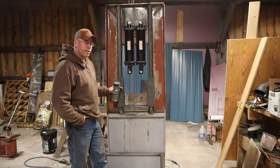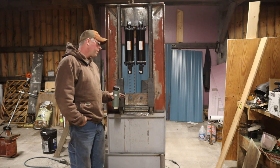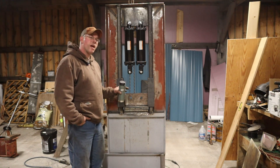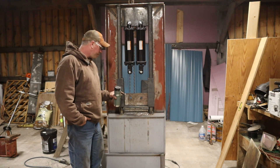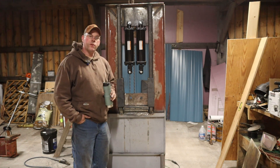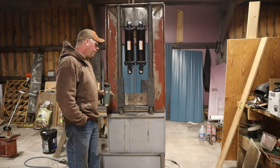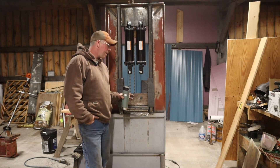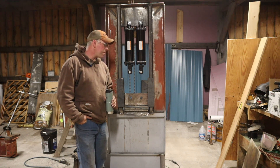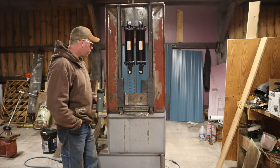I have a plan to hold the slides in place. I left just enough room to use that old cutting board material — that style of cutting board is what they use in a lot of power hammer slides. It actually wears really well. We're going to cut a little oil groove in all of them so we can keep everything lubed up. It's oil resistant — it's had chainsaw bar oil all over it for years, been sitting out in the pit of despair for probably close to 10 years — but hopefully it should hold up.